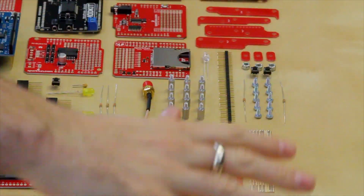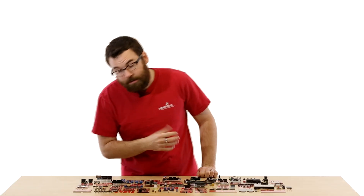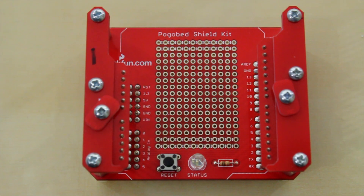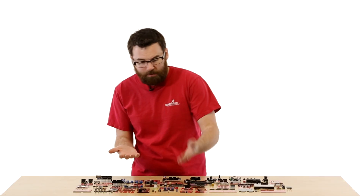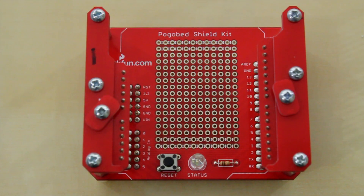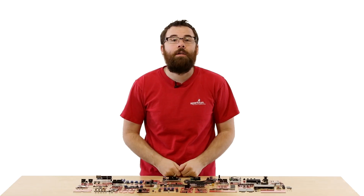This is all the pieces for the Pogo Bed Shield Kit. The Pogo Bed Shield Kit is an interesting product that actually came out of testing. When you put it all together, you get your own Pogo Bed. The Pogo Bed uses these little Pogo pins, and you put this on top of your Arduino and then you can press-fit a shield on top of it because of the little springy pins. It allows you to do prototyping and testing with the shield without having to solder anything. It takes the place of normal headers by using these little spring pins, clamping the shield down without needing to solder.